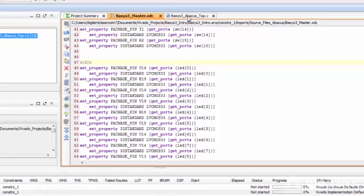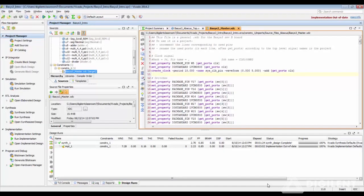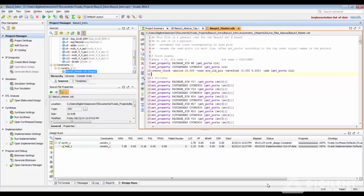Save the file. Now let us begin the process of programming the FPGA. There are two ways to program the FPGA. One is using the bit file — we use the JTAG programming cable to load the bit file into the FPGA. The second method is programming the FPGA using the QSPI. For this, we need the .bin file, the binary file, to be loaded onto the QSPI. When you turn on the FPGA, it will load the programming file from the QSPI and you don't have to go through loading the bit file through the cable.